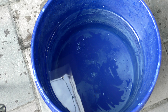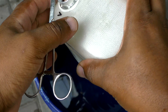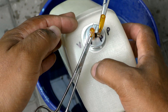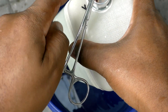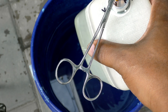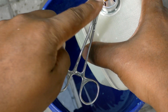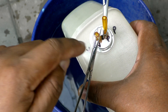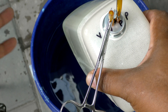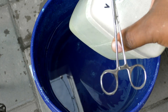It's time to leak test our tanks. What I've done is installed my fuel fittings correctly and blown air into the tank and then clamped it. The goal is to dunk this in water and make sure I don't see bubbles. Then once that's done, I want to unclamp one of these lines — what I want is for the air that I blew in to escape. That tells me the tank is sealed and there are no pinholes or any other way for fuel to leak out of it.